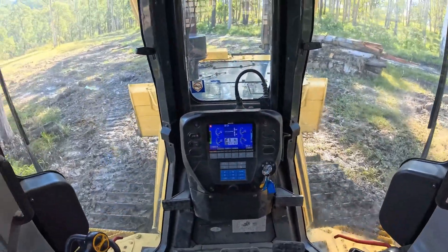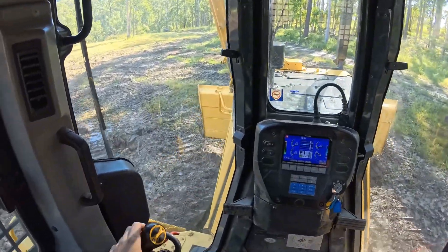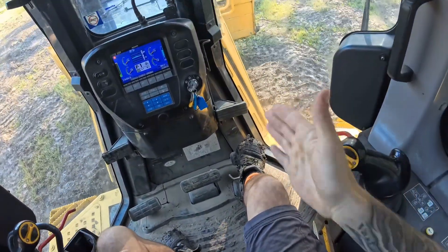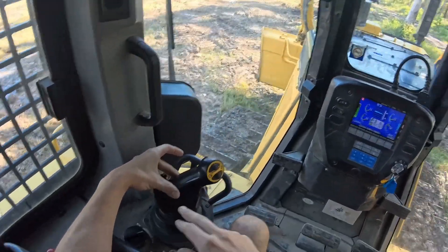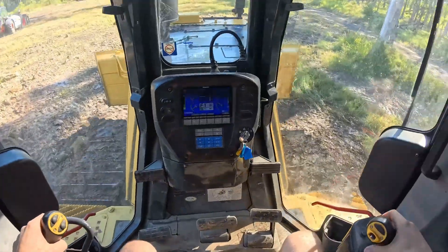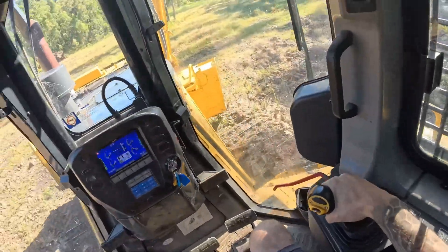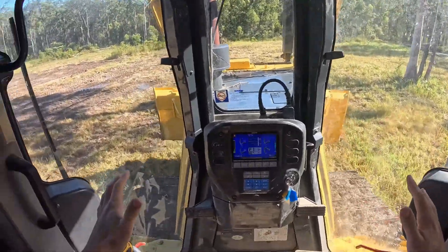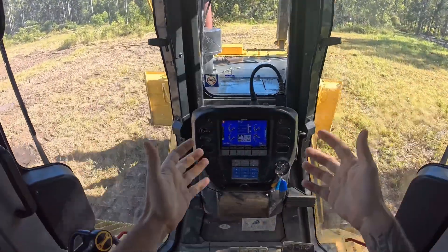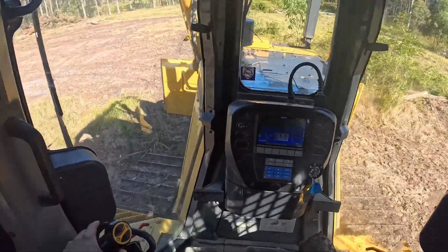As you can see, the dozer drives itself. If I passed out in the dozer, it would just keep on going. There is nothing stopping the dozer unless I slow it down by putting my foot on the decelerator, or take it out of gear by pulling this back. This is how easy it is to turn the dozer — it's just left and right, a very small increment. With your blade, you really want to be very slow when moving it around. We're going to do our first mud cut, so let's see how wet it actually is down here.